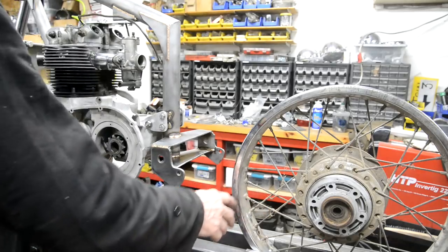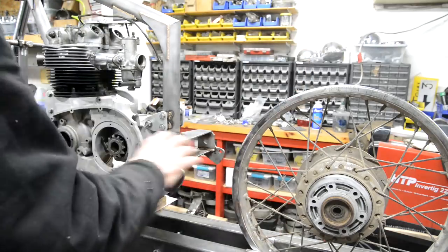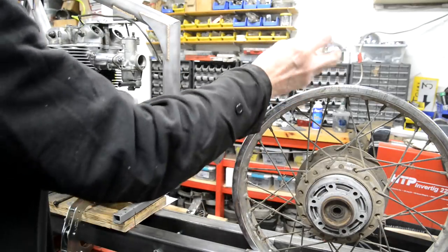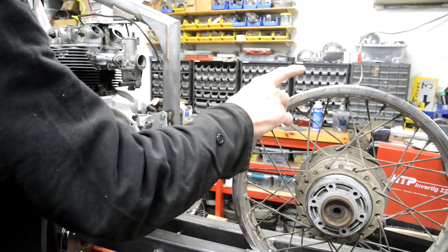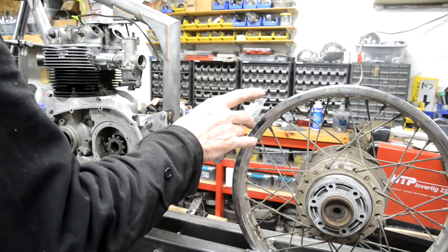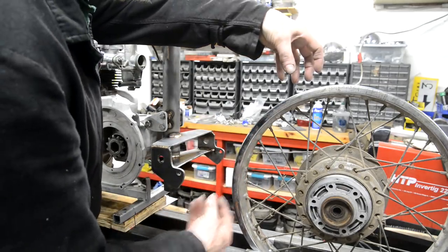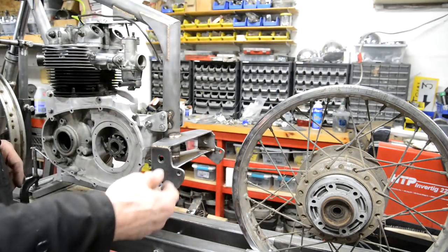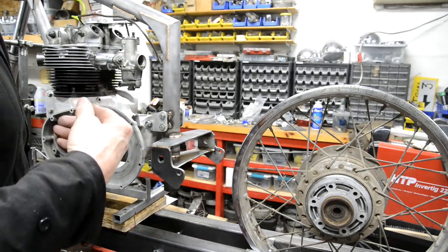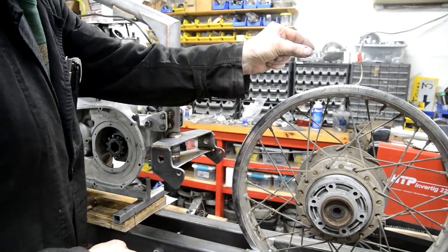Next week, we're going to take the wheel out so that I can put a couple of these on up here. We'll put the swinging arm in and we're going to make the rear subframe and the top mounts for the rear suspension units, which are going, again, to be a little divergence from the Otter system, which uses the sort of standard thing of plates where the rear suspension unit goes inside. I'm going to do the type that I do on my trials bikes, where it goes onto a projection, if you like. The thing about that is it moves the tube in an inch on either side, and I want to try and keep this as slim as I can.